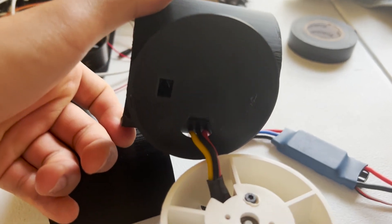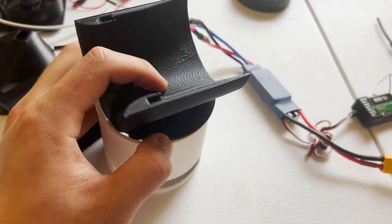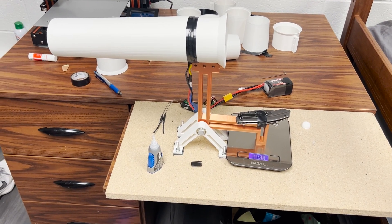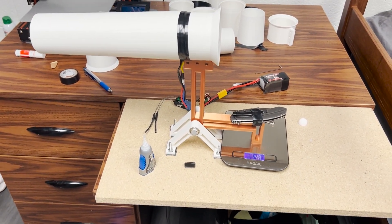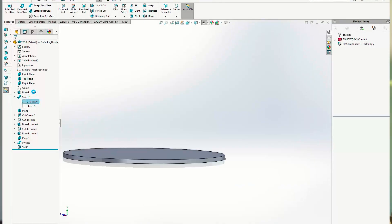There are a list of aerodynamic difficulties I've come across. Number one is controlling the mass flow of the fan to airfoil transition — I think my slot was way too small, something like one centimeter by 0.75 centimeters. As I saw in my EDF testing, converging nozzles or converging designs like this tend to cause things like flow reversal and generally lose out on efficiency, as opposed to speeding up the flow like it should in theory. So I'm barely getting any air out of the fan unit in the first place.